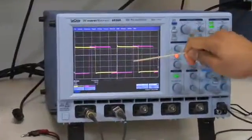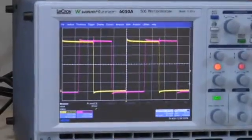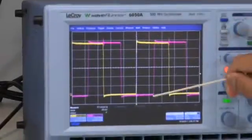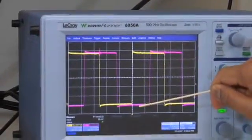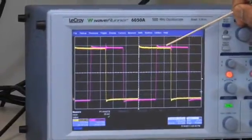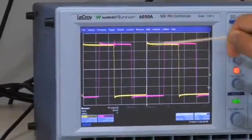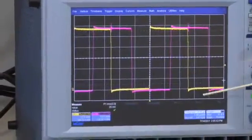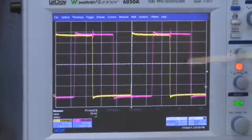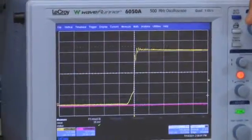These waveforms are going up and down because the input voltage is deliberately being ramped up and down. Let's stop at a high line. This demonstrates that one switch node is pulled high and the other is pulled low, showing a power transfer cycle followed by a freewheeling cycle when both switch nodes are at the same potential. In the next switch node cycle the opposite happens — the switch node which was high goes low and the one which was low goes high. That is the second diagonal being turned on, initiating the power transfer cycle.